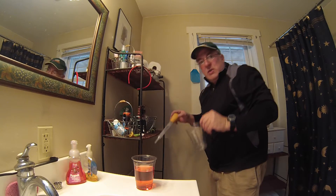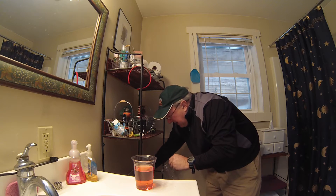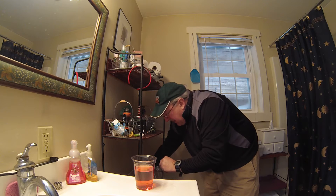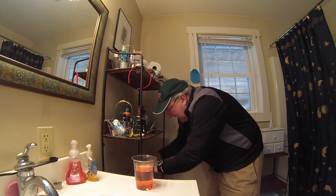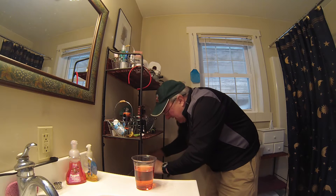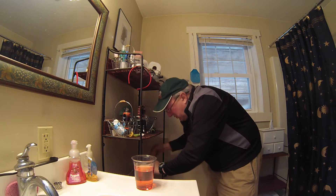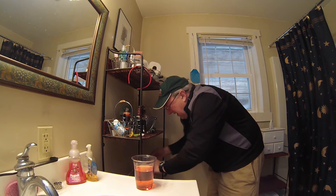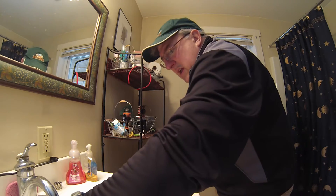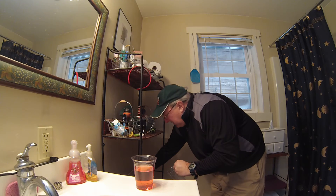I've got the baster and an extra cup, putting the baster in the tank, getting some water. It's a lot easier to do this — you put it into the cup. It makes a lot less back and forth, a little cumbersome but it's all worth it. The more water you get out, the less antifreeze you have to use. As the cup fills up, I just carefully pour it down the drain here. I know it's a little gross but it's a sink.